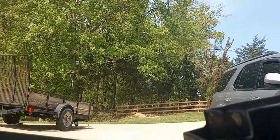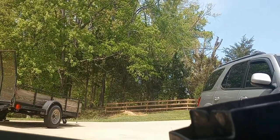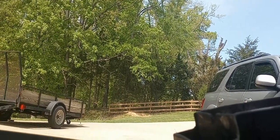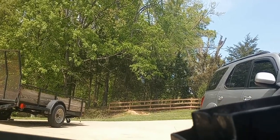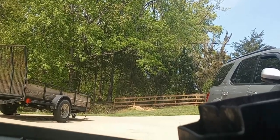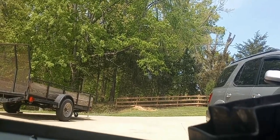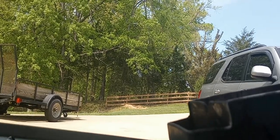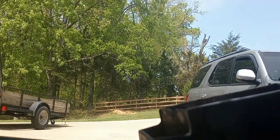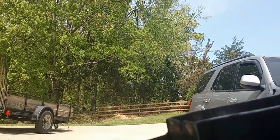So it's all about learning how to do it and getting in time with it, keeping your lid put in at the appropriate time. These pots run about 2.25 pounds a minute, and it takes warm weather. You try to do this on a cold day, and the pot can't keep up. It takes warm weather, at least in the 70s, before they can keep the lead flowing consistent. Any cooler than that, and they'll kind of stop and start, and you have to wait on them. But that's not a big deal either. It just slows your production down a little bit. I usually make about 125 pounds of shot per hour, and that's just sitting there, watching, listening to the birds sing.